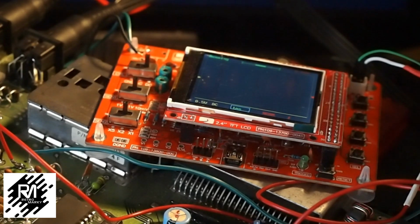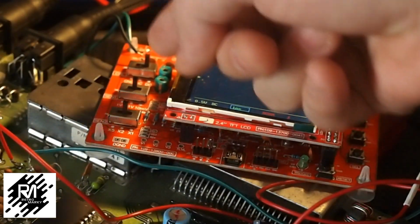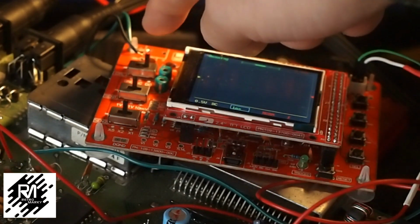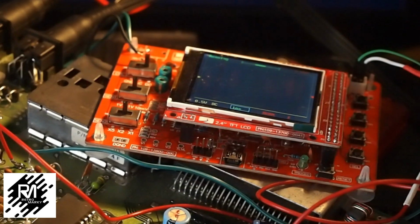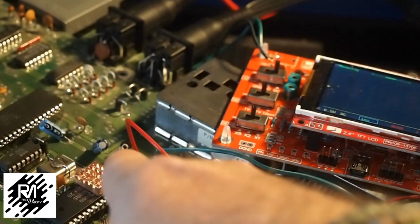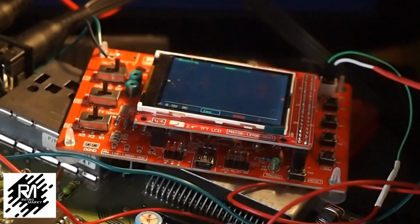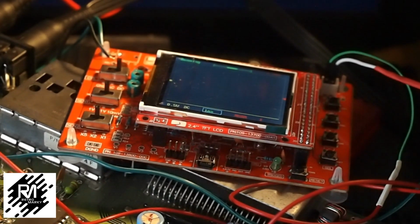So all I've basically done is make it simple as: remove the BNC connector, so that the audio can go straight in. And then this is just a simple bodge power job, because it can run off I think up to 12 volts. So I've just pinched 9 volts off the board, which you can't really see that well, but I just found 9 volts using a multimeter. Simple as. So that's the technical stuff. Let's get down to the fun bits.